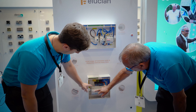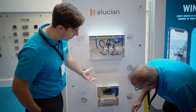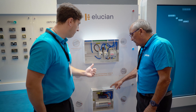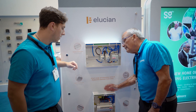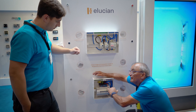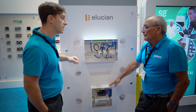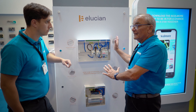We stripped the cable and all internal wiring comes with complete ferrules as standard - what you see is what you get. There's good room between the neutral bar and the RCBOs, with the neutral at the back. We were conscious about space, enabling contractors to work to the best of their ability. We've got blanks, a robust grommet strip at the back that's a very tight fitting. There are 40mm, 32mm, 25mm, and 20mm knockouts all around the surface of the board. The torque settings are placed in the back of the consumer unit at the top, telling you exactly what settings you need, and it's been designed alongside Unicrimp's torque screwdriver which fits in there already.